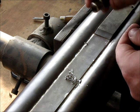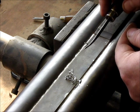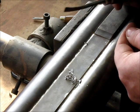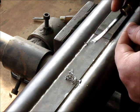If you ever pop this joint apart, then you have to obviously come back in and re-solder it, refit it, get it all back down. But it also means you have to recheck your regulation, because if you mess with any of this at this point, you can mess up the regulation on it. So it's really kind of a slow job.